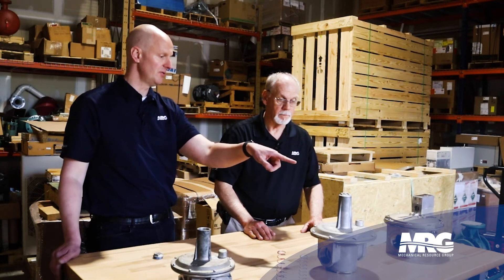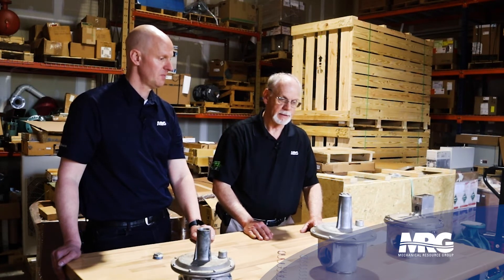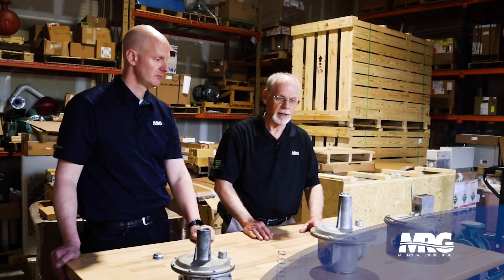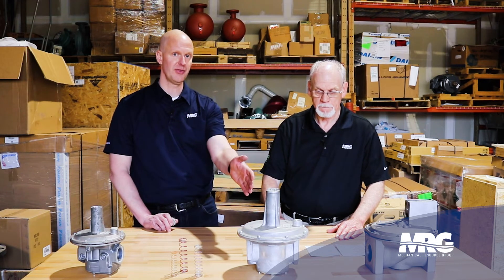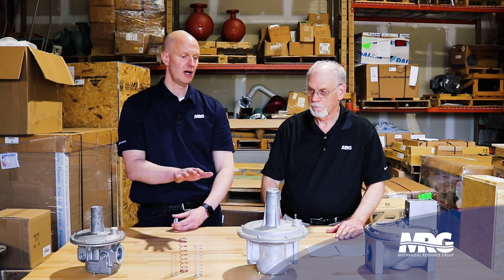If outdoors, put a vent preventer on there so water or debris doesn't get in, but the vent still needs to be open to atmosphere for reference pressure. When piping the vent outside, use copper tubing — not PVC. Copper will withstand temperature changes, and in the event of a fire won't deteriorate and add to the problem if gas is being expelled. Never use your gas regulator as a shutoff valve — always use a dedicated shutoff. Also install a strainer before the regulator to prevent debris from getting in.